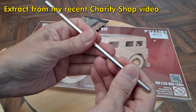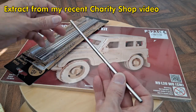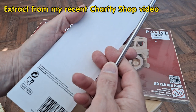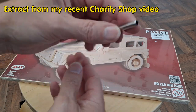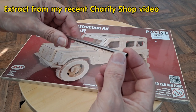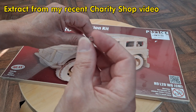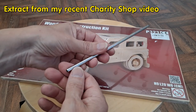It doesn't feel like it bends - good. So that's one single stainless steel shaft, about 20 centimetres long, which will be plenty long enough. I do need to work out some sort of plastic seal at either end. I could 3D print something, but with the shaft spinning fast in PLA, the PLA will go soft and melt, so I might have to think of something else - maybe find some sort of nylon I can put in either end. We'll find out if it works when I finish the boat.